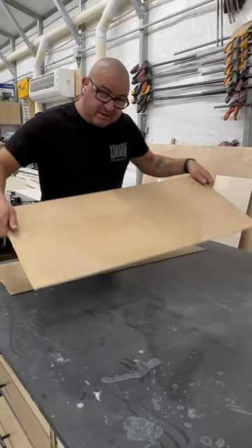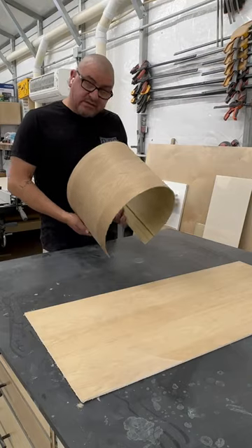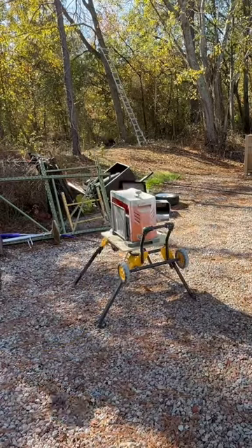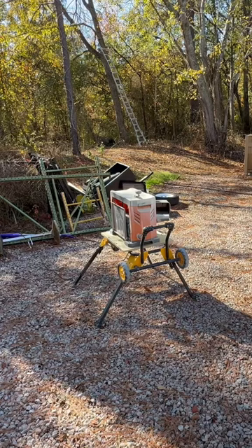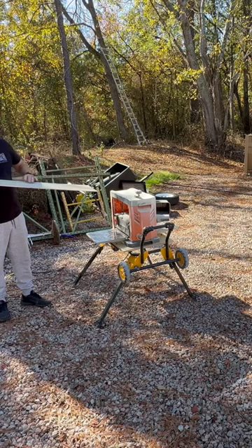Check it out. I'm going to show you how to turn this hardwood plywood into a hardwood bending plywood. The way this works is you're going to set up your planer — it doesn't matter how thick your plywood is — you're going to plane everything off except for the face ply and the perpendicular ply behind it.